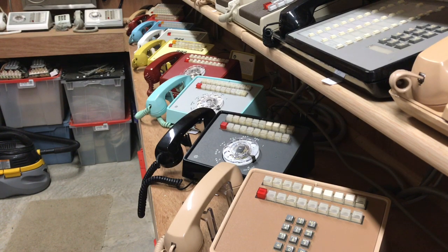Then I had some defective intercom cards that I had to work through. In addition, certain cards needed to have a certain revision or be a certain number such as 424 A, B, and C. I had to have the later generations — anything other than an A series card — and that was a difficulty because mostly what I had was A series cards. The multi-link card was either damaged because of trying to make it work in a damaged panel, not knowing the panel was badly damaged on the backplane, so it is not operating correctly and I am in the market for a new three-link card.